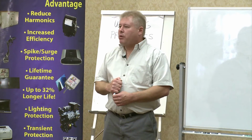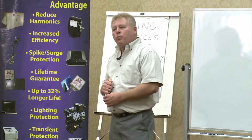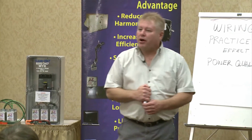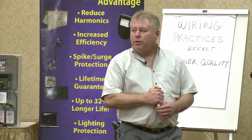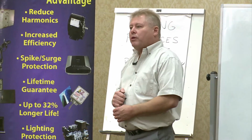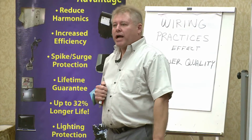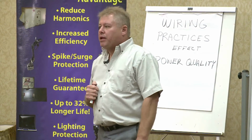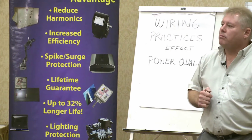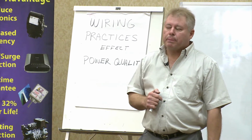And harmonics are probably one of the hardest things to reduce. But once again, what was the problem? The problem wasn't the harmonics, it was the energy surges created by the harmonics being produced, deviating the fundamental voltage waveform, and all of those surge energies were hiccuping their power supplies and causing constant resetting. I mean, their IT people were going crazy because of the problem. And it's a nerve center. I mean, it's a big airport.